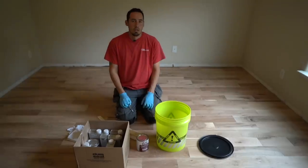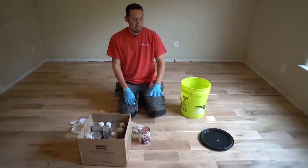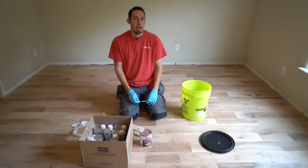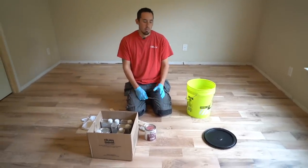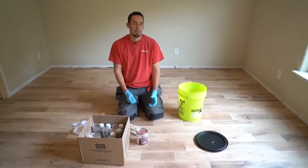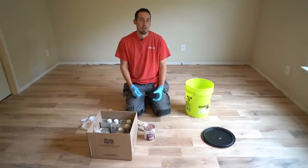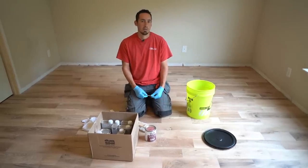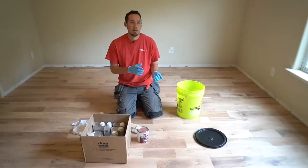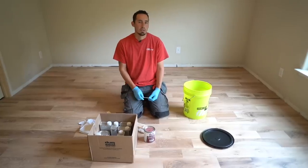Here's the deal with this floor - you can see how it looks naturally with nothing on it, completely fresh sanded. I like the way this looks and I want to keep it as close to this as possible. The way we're going to do that is by mixing two colors of stain. I found that mixing these two stains gives a really natural look on white oak. The blog I found this on called for half country white and half neutral, but that was a little too white for me.